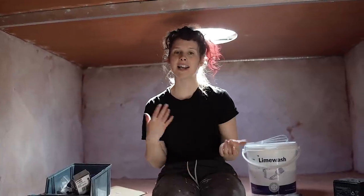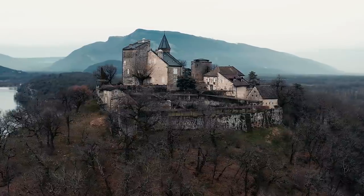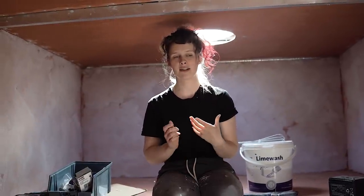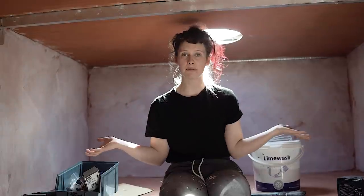Before we get started on building the kitchen, I'm going to be painting the van walls. We've gone for something a little bit different, experimental in this van — rather than cladding like we usually do, we've put in plywood walls and I'm going to be whitewashing them with lime wash. Lime wash is something you'd normally see in old Italian buildings. It's got that kind of watercolour-y texture, but it's also used on old English buildings, mainly on the outside of stone and masonry. So I'm going to be applying it to plywood, which is a little bit different. There are a few advantages to lime wash over normal paint — mainly it's a much more natural, sustainable alternative because it doesn't contain petrochemicals. Best of all, this lime wash actually comes from Bodmin in Cornwall, so it's really low-carbon. And when it's all applied, it's also breathable — it inhales moisture and then exhales it — so I think that makes it really good for using in a van.